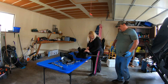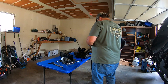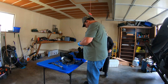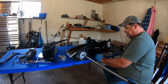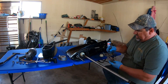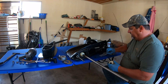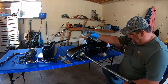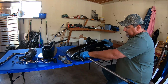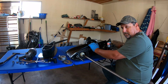Just grease this before you put it back together. There's the impeller — old impeller. Here's what comes in the new kit: there's the keyway that aligns the impeller, the impeller plate, the impeller gasket, and this is the seal that seals the gear oil — the kit comes with new seals — impeller plate, impeller gasket bulbs, impeller, and impeller housing. You don't necessarily have to do the new keyway every time; they claim as long as it hasn't leaked water into the gear oil, you're normally good with that one.